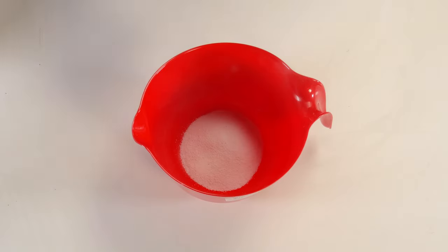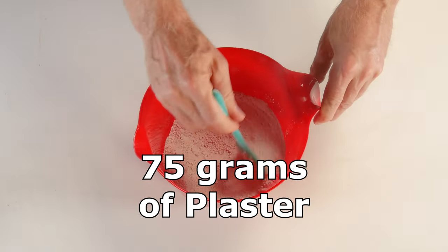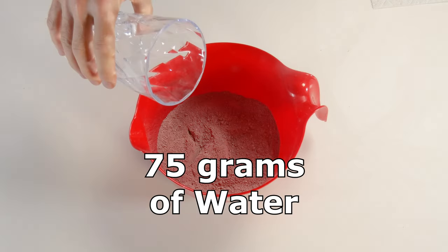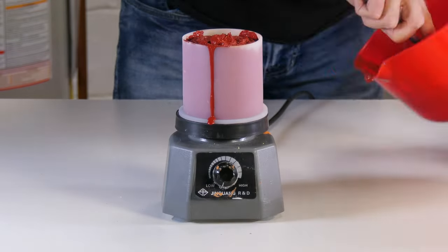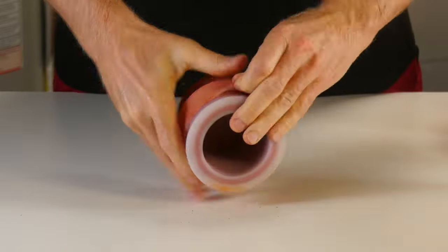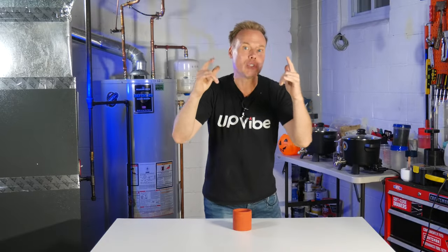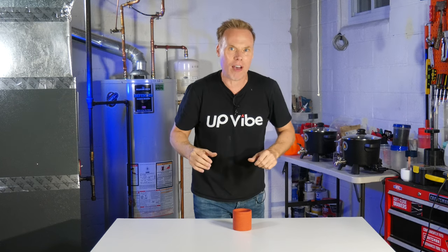Jay's formula. My formula has approximately a 2 to 1 to 1 to 1 ratio. I'm mixing 150 grams of sand, 75 grams of cement, and 75 grams of plaster together thoroughly. Then I'll add and thoroughly mix 5% — 15 grams — of red pigment into the mixture, followed by 75 grams of water. Once satisfied that it's mixed thoroughly, I'll add that to my Amazon silicone mold on the vibrating machine and let it dry for three hours before demolding. I purchased a 50-pound bag each of sand, cement, and plaster from my local Home Depot for a total of $45.72.